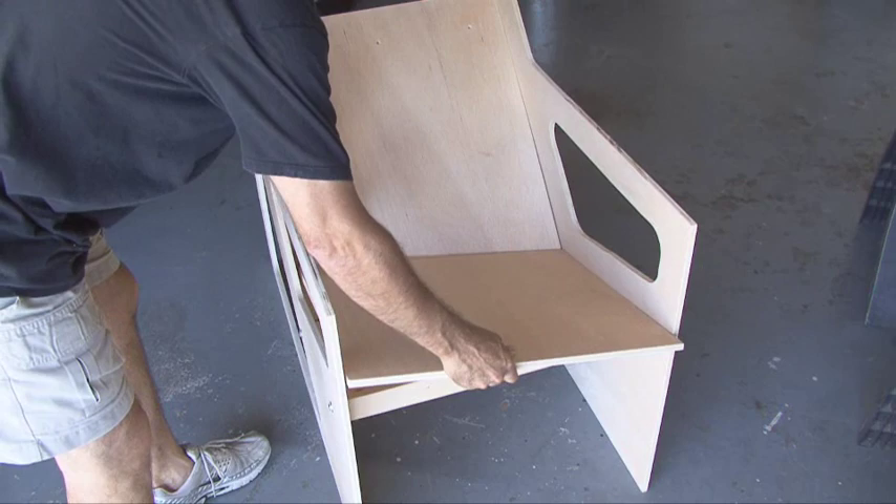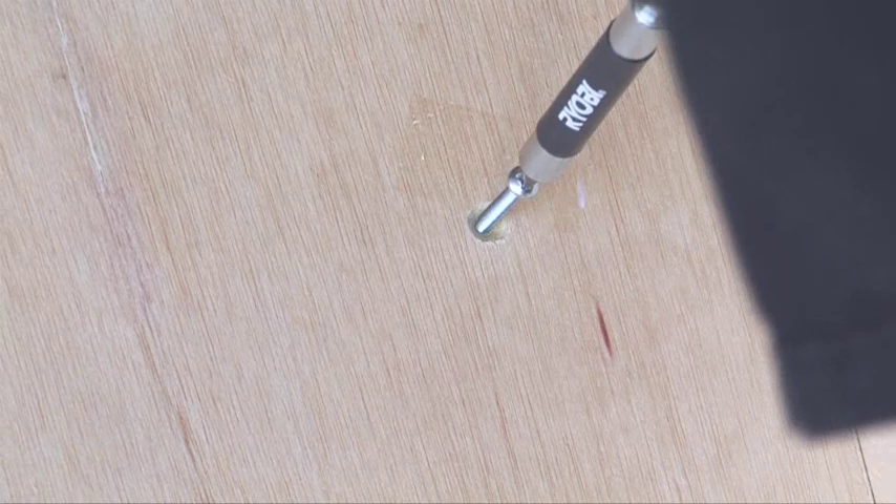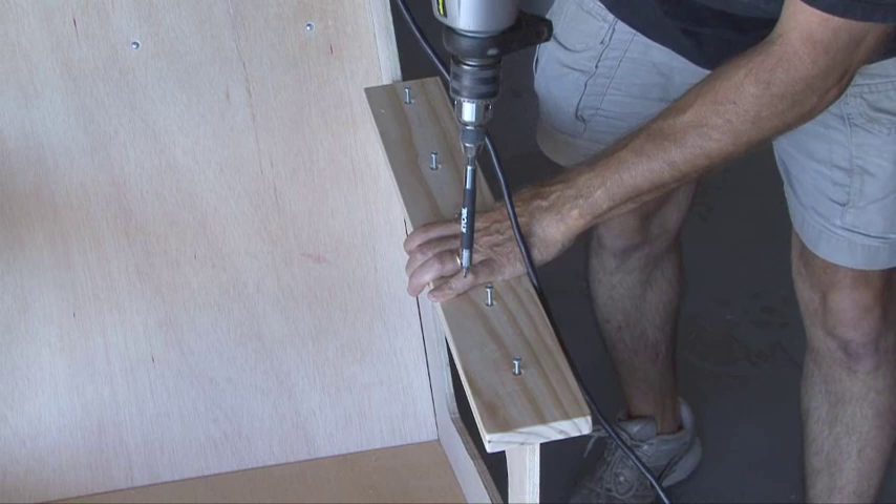The seat bottom is put in place and again that should be a nice snug fit. The seat back will be attached to the top cross brace using wood screws, countersunk so the screws run flush. The last step for comfort is armrests made out of 1x4 wood. We'll pre-drill the side pieces and then add screws to the armrests, and after everything matches up, attach each armrest.